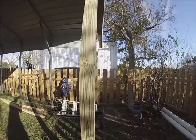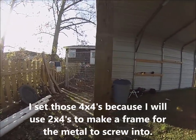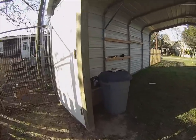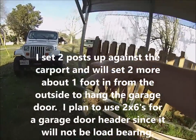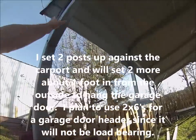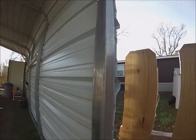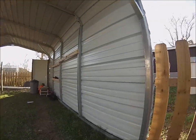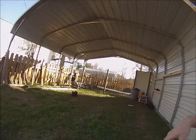You can see looking straight across how perfect that is, even going this direction — pretty good. You're not going to see these interior posts anyway. What we're going to do is the same thing here: put a post on this end that goes seven foot tall, move this bracket, put a post on the other end seven foot tall, move that bracket in, and then when we get our garage door we'll go a foot in, put a post up, and frame that out to have the garage.